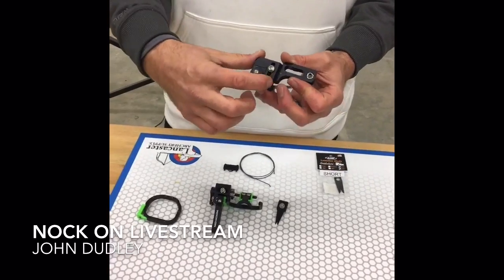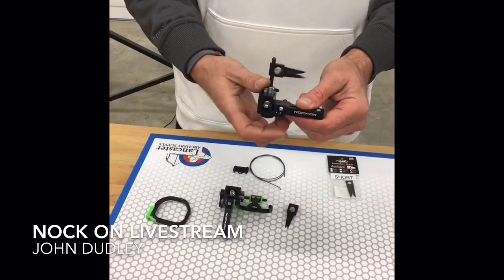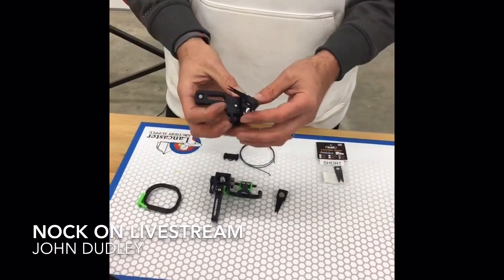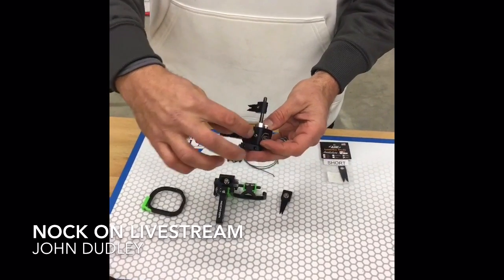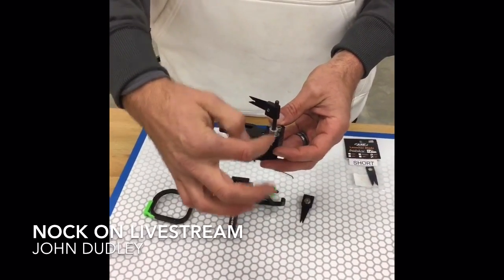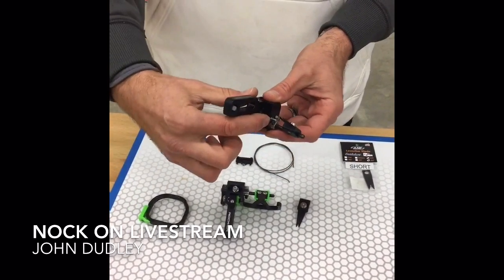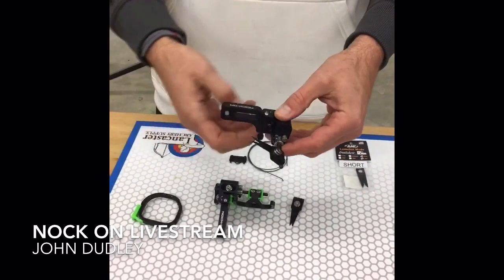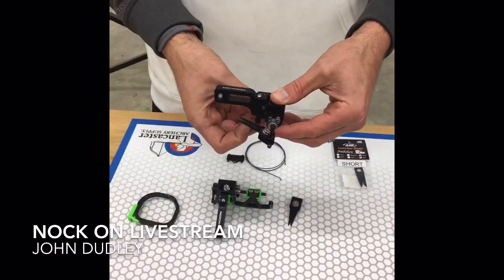From there, the new lever bracket is finished. This thing's awesome. This is the new lever bracket. You're actually going to be able to shoot a blade with tension. You can adjust the tension with this lever arm if you want. What's nice is you can tighten this set screw on the bottom, and it'll lock this rod into position. From there, you can loosen this screw and move this collar up or down to adjust your blade angle to the position that you want.